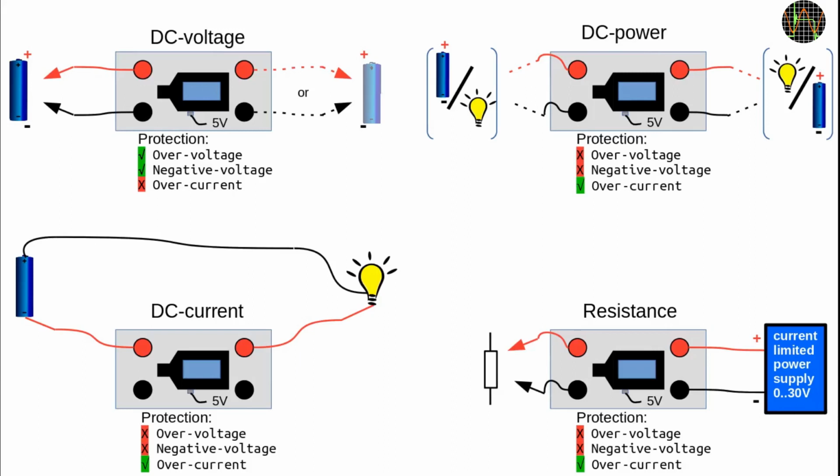Limited to the 4 use cases for the TC66, I find that the only time I'm casually using probes on multimeters is to measure voltages and resistance. For measuring current, I normally wire the circuit carefully in advance. This is why my circuit for the TC66 primarily protects against silly mistakes in the voltage mode. The other 3 measurement types require the TC66 to be carefully set up and wired in anyway, so the danger of swapped polarities is fairly low. For resistance, you can use probes on that end if you like, and polarity doesn't matter.